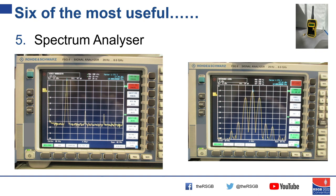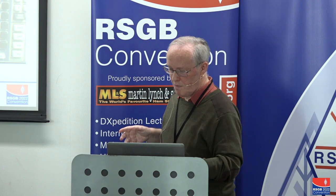A basic analyzer is £78. If you want a benchtop one, you're talking over £1,000, and you can pay as much as you like. It's amazing that they're starting to become affordable — 20 years ago, you would not have thought of having a spectrum analyzer in your shack unless you built something effectively acting as one. You do see this sort of thing with an SDR, which looks at signals across the frequency domain, but a spectrum analyzer is accurately measuring power, you can alter the resolution bandwidth, and you can see a fair way down.